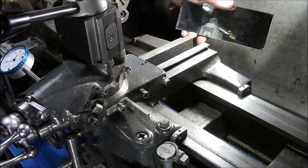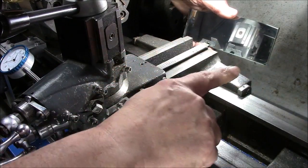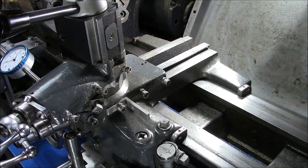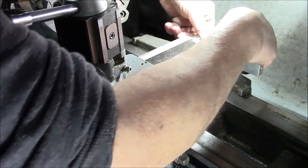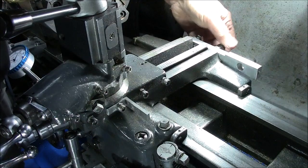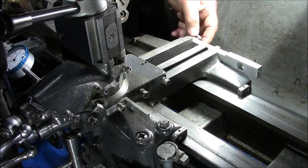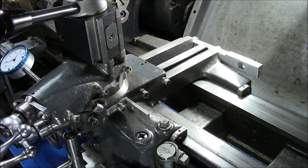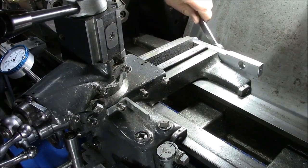Now here's the installation of the x-axis support — a little trickier. Here I'm pointing at a couple of holes on the back of the cross slide, which are actually the support holes for the travel rest, and I wanted to reuse those holes. So I formed a bracket that uses those two holes, screws in, and has a hole for a 5/8 inch rod. Since the casting was not square on the side — it was machined square in the back but there was no machining on the side — I had to put in a grub screw that allowed me to cant or angle the back end just slightly.